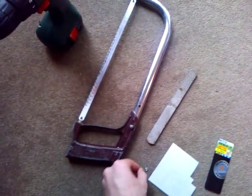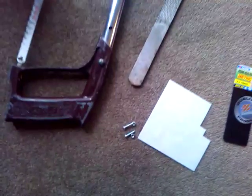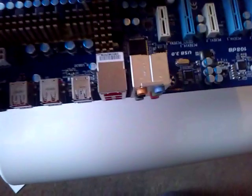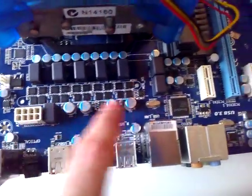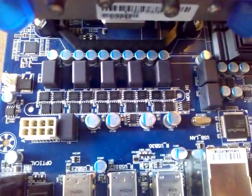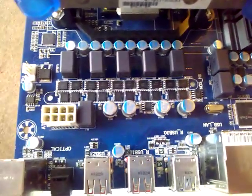Now we're going to attach the heatsink with two screws that are 3x15mm, and their corresponding nuts. And here we've got some thermal transfer tape — it's actually fairly thick thermal transfer tape. We need that because we have a component here next to the MOSFETs that is ever so slightly higher than the level of the MOSFETs. So with this thick transfer tape, we'll be able to rise above that and only cool the MOSFETs without an uneven surface.